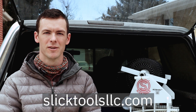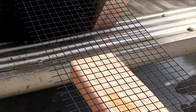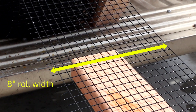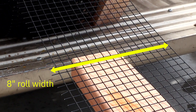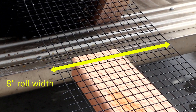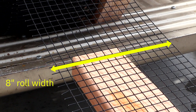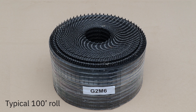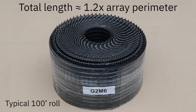Let's talk materials. We won't go into vendor recommendations in this video, but you can find those on our website. The wire mesh should be made of galvanized, plastic-coated steel and have half-inch openings. The mesh comes in rolls of various widths — 6 and 8 inch are the most common. The mesh should be at least 2 inches wider than the roof-to-array gap. For example, our 4.5 inch gap demands at least 6.5 inch mesh, so we round up to 8 inches. Plan to use a length equal to your array perimeter plus 20%. Our perimeter is 90 feet, plus 20% puts us just over 100, so we'll bring 200-foot rolls to the job.